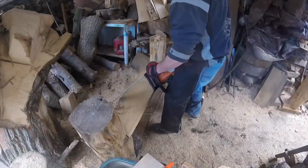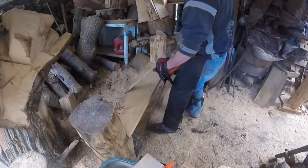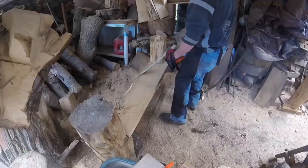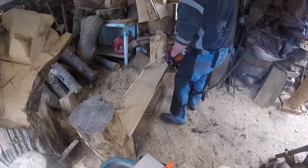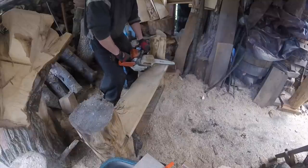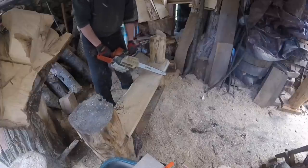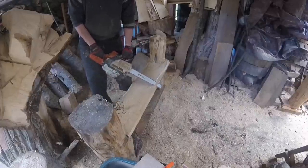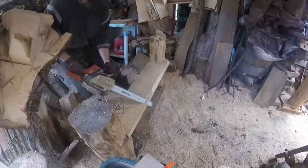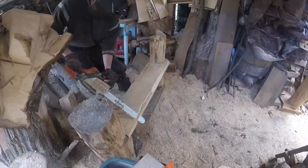As you guys can see right here, I got my saw making some cuts so it can have a live edge look on that bench. I'm just doing a real steep angle, and you guys can see what I'm doing there. So that'll also get sanded out with the angle grinder later, so there's no slivers or anything like that. But this is a quick way to give those boards that live edge look if you don't have a piece of live edge to work with.